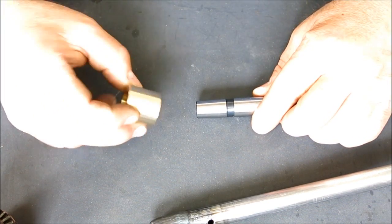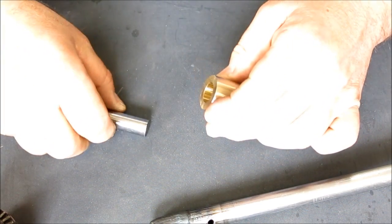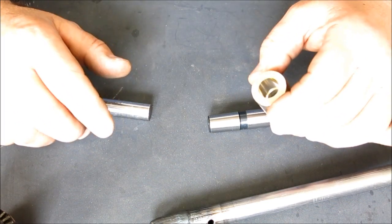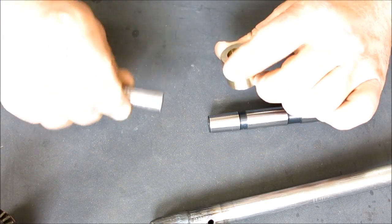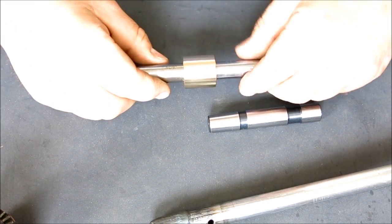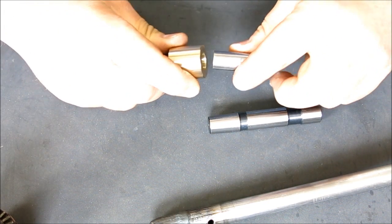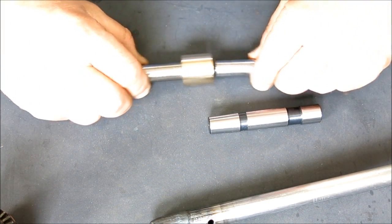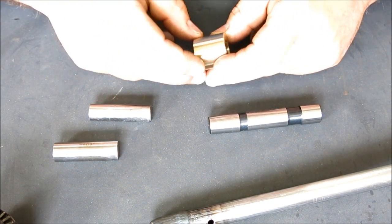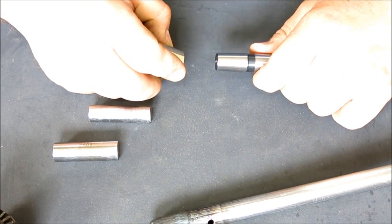This gauge I just made off camera — there's nothing fancy here. It's got two diameters: a large diameter and a small diameter. I just bored them. If you're a thousandth over or under, it doesn't really matter — the key is that you need to know the diameter, and that's easy using plug gauges. We stick those in and now we have known diameters. You can see those fit real nice with a piston fit. As long as we know those diameters and the length between the faces — and they're parallel — we can use this gauge. This is traditionally called the two-ring method.